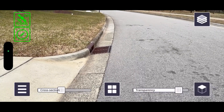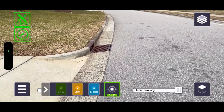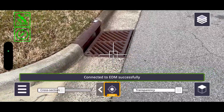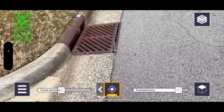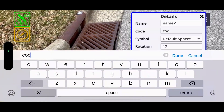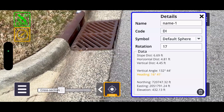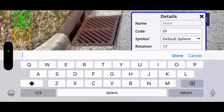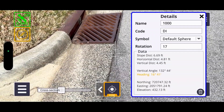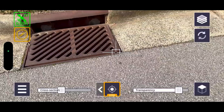Now I'll turn the model off and go to the menu to look at how to measure points. Tap the point icon and choose between EDM, model, or GNSS. I'm carrying this in handheld mode. I'll walk over towards the DI, aim at the corner, and hit the EDM button to take a measurement. Once done, I can type in a code — DI in this case — and update the naming convention, calling this point number 1000. My heading indicator turned yellow — I probably tipped the handle a bit too much. To remedy that, just walk around a little to turn it green again.